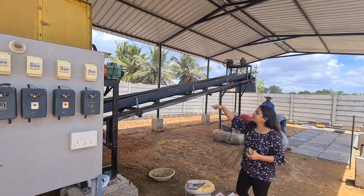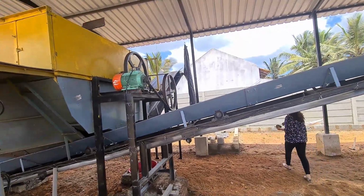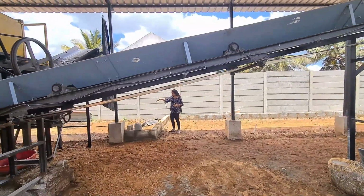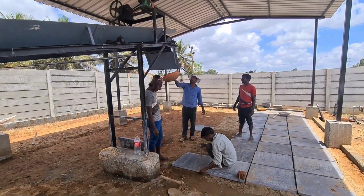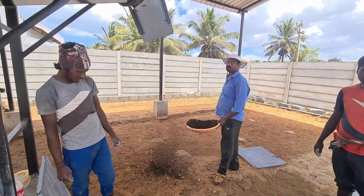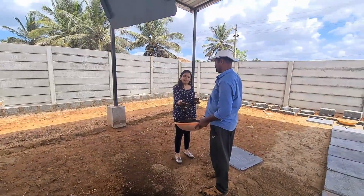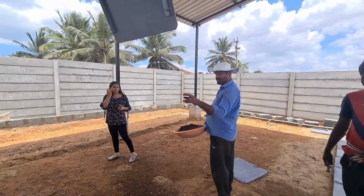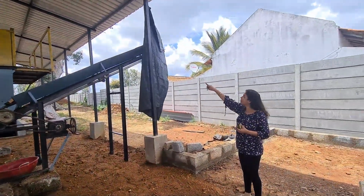The two basic things that happen in the machine are the removal of waste and larger strands from the pure Cocopeat mix. Here is the final Cocopeat after segregation. This final form is low EC Cocopeat, which is used for plants, as it's low on pH. We add Pseudomonas and Trichoderma enriched microbial mixes to hasten the growth of plants. This is the second conveyor belt, which removes the long strands from the Cocopeat mix.